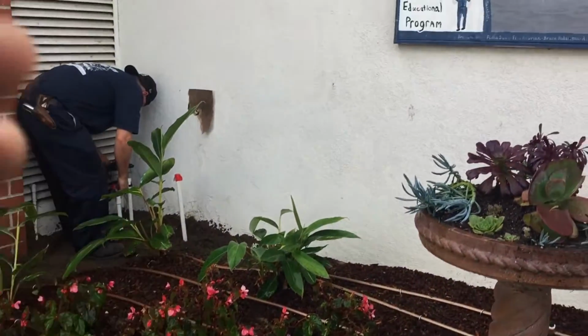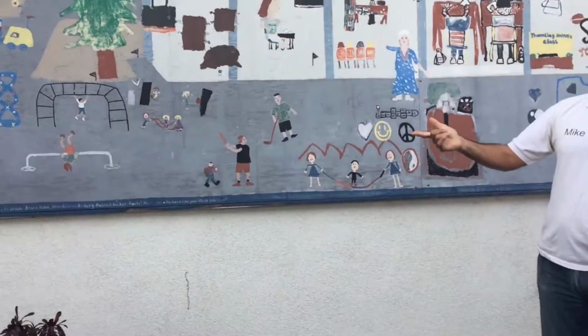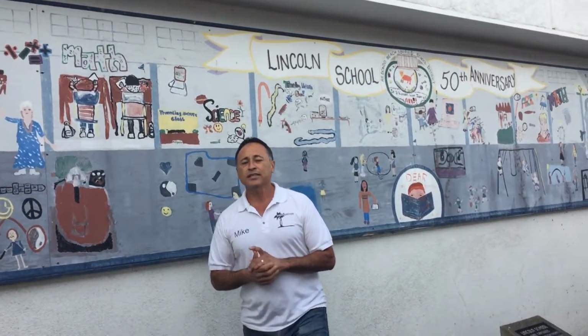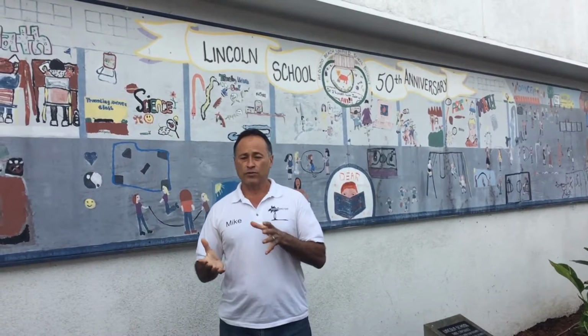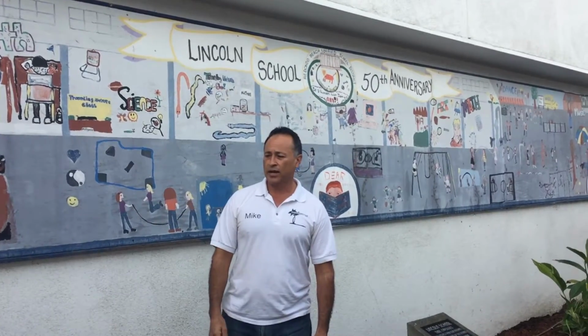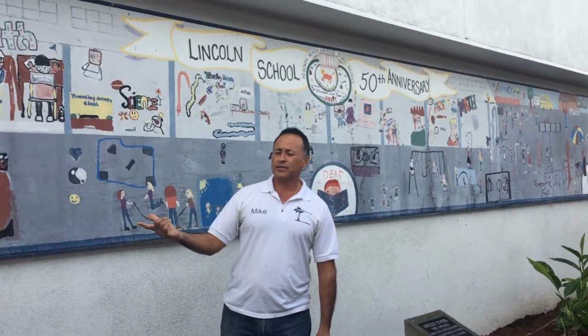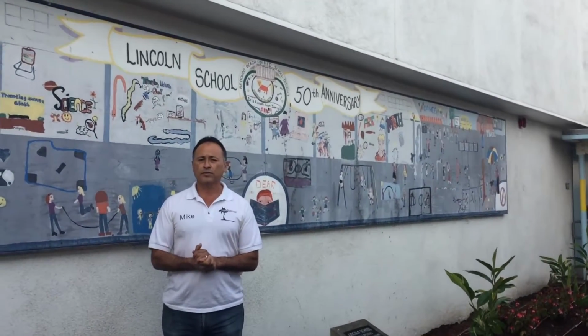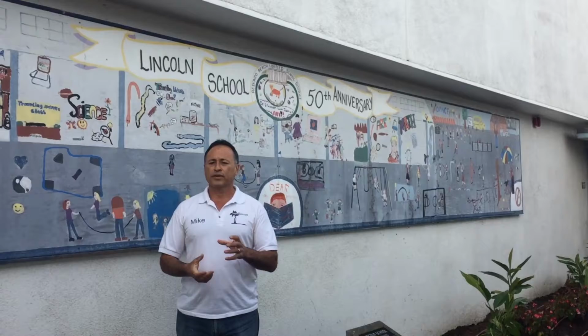So for the gentleman in the corner over there, just put in the Rainbird valve, putting in the timer that's connected. That's an amazing thing, that you don't need electricity for a typical clock that plugs into a wall. You can actually use a battery operated timer, which we highly recommend. And then on the valve, there's a built-in pressure regulator as well as a clean out.